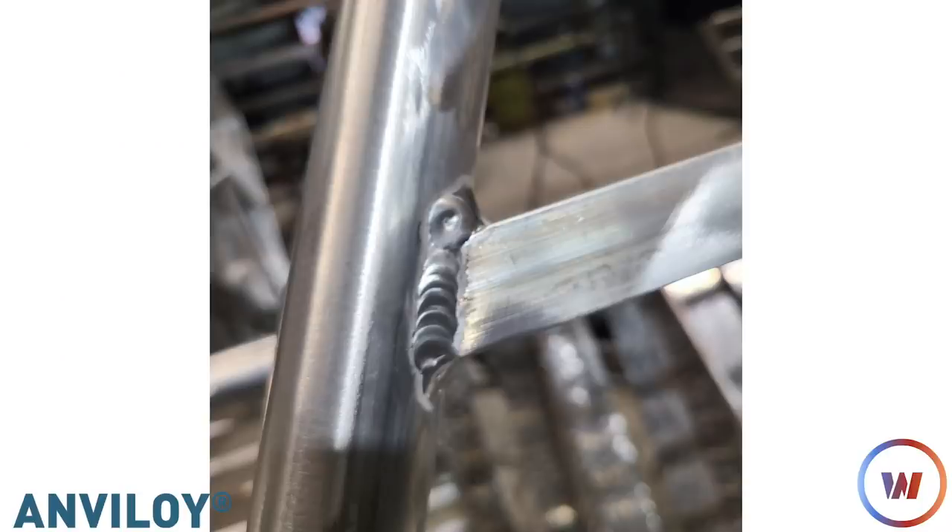This is to avoid having a crater hole or a fisheye in your weld. The time span of the current reduction is determined by the height of the welding current — with a high welding current the time span is longer than with a low welding current.